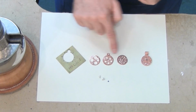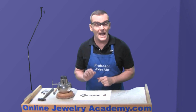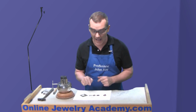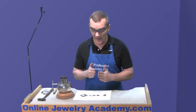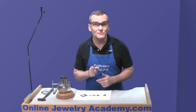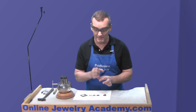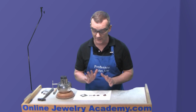Now all of the holes that were made on these discs were done with a drill. And each was initiated with a small pilot hole, and for these larger drill holes, they were made using a series of drill bits that graduated to larger and larger sizes. Doing that will keep you safe, because if you work with a small drill bit and immediately go to a large one, you're basically making a weapon, and you don't want to do that.